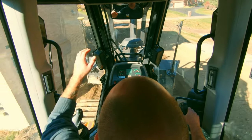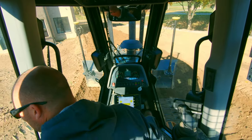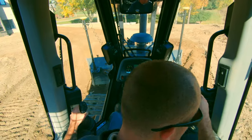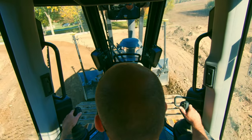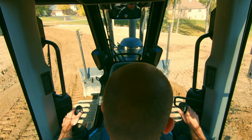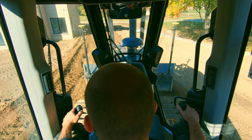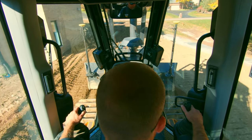One of the fastest ways to really up maintenance costs on a dozer is to run at its fastest speed all the time. That's really hard on the undercarriage. You want to balance speed without going crazy. There are jobs where you're full speed the whole time, but to do that for the entire life of the dozer really diminishes undercarriage life. When you can chill out a little bit, you want to — it will save you thousands of dollars in maintenance costs on rollers, sprockets, track chain, and all the really expensive stuff.